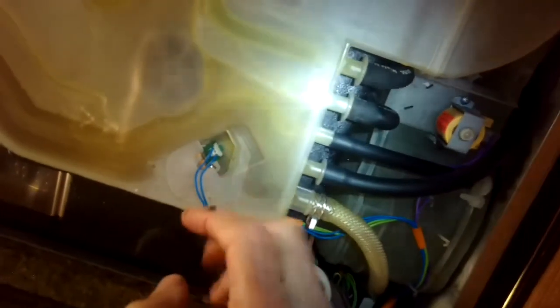Just replace this thing and it's going to fit in like that. Push it in and it'll click into place. Put the power connector back in — when this goes back in, the green part's open area is facing you and the little tab is away from you. Push that back in and click it in. There we go. That is a very common problem with the Miele dishwasher — if that wheel gets stuck or that little diode gets burned out. Easy to fix.